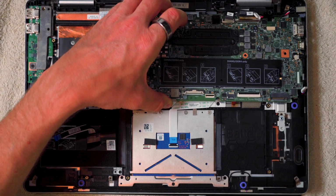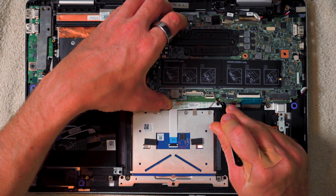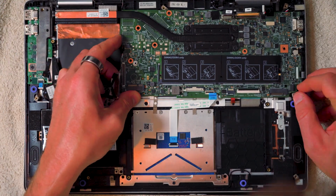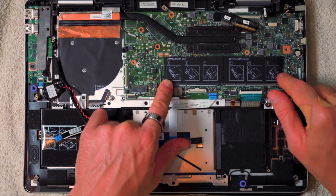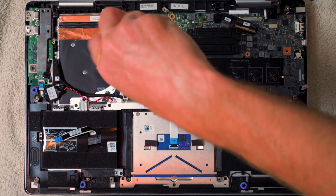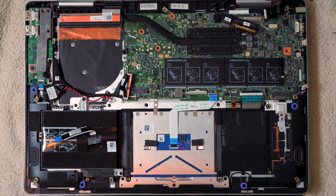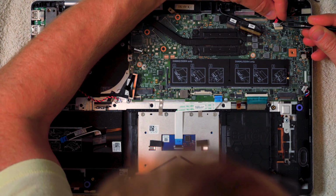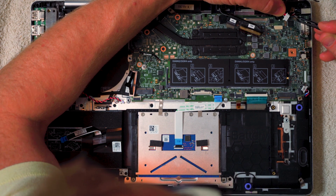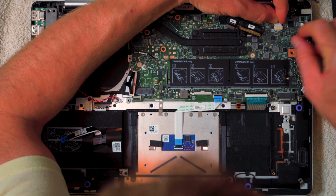So just make sure that all of our cables aren't going to get trapped underneath. And that can be a slightly frustrating process, but have patience. Okay, there we go, that's located quite nicely. So now we can go ahead and screw the motherboard in. Okay, so that's great. The next step is to connect the new battery connector that you've just applied. Do note that it's this flat bit here which goes on the top, and the bit here with all of the little tabs, that goes on the bottom facing the PCB. Okay, so do be careful of that.